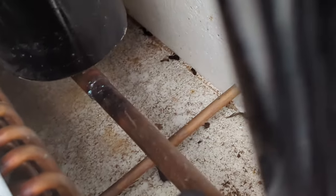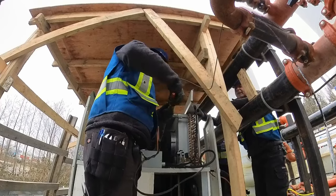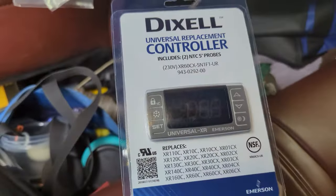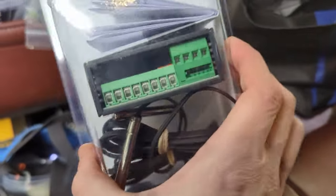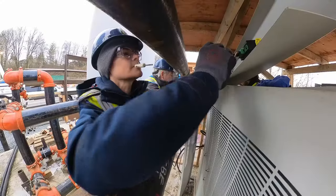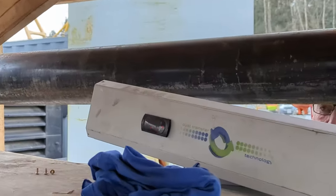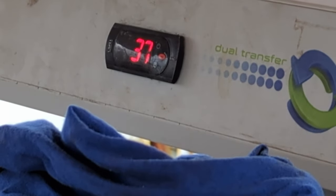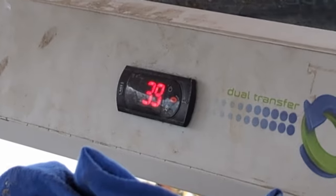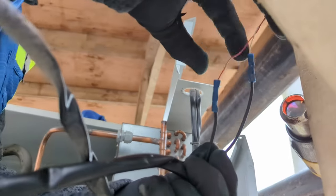That sensor goes right through a little tiny copper tube into the heat exchanger and it's covered in dielectric grease — white stuff. When we started investigating, Trevor found a bunch of moisture in the wire connections. So we wanted to test the controller and the sensors to make sure they were actually faulty. We brought an extra controller and a bunch of sensors. I wired in a new sensor and tested it by holding it in my dad's warm hand and watched the temperature rise, and when he let it go — it was about minus five degrees that day — the temperature dropped as well. That confirms the controller is functioning. We wired in the old sensor and performed the same test and got the same results, so that confirms both the temperature sensor and the controller were okay.